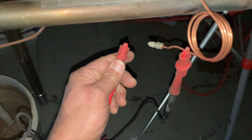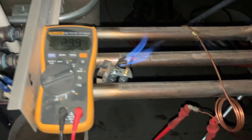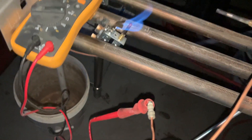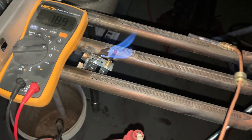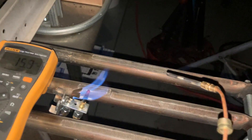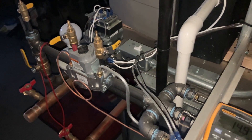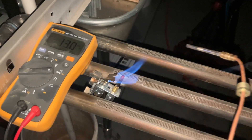And as I take it away, we drop. That's why if you were to blow out the pilot flame on your pilot burner, it stays on for a while until the thermocouple cools and drops below an acceptable millivolt level — no longer keeping the gas valve pilot burner valve open.